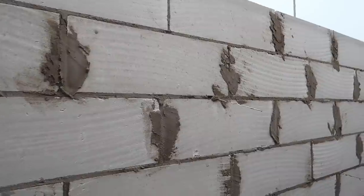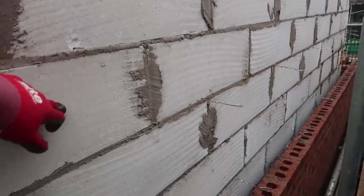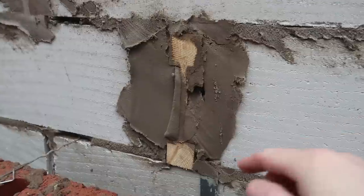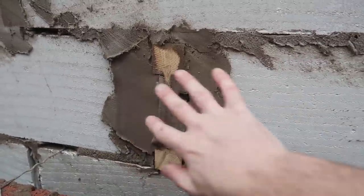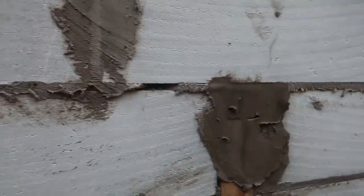That's what we're looking for at the back of the blockwork as well — nice full joints, nice and clean, all scraped off. The insulation is actually being pumped in after the build, but you've still got to keep your cavities clean. That's what the joist sits on top of at that height. The joist goes on there for the floor, and then you just put your blocks in between and then you build over the top — that's how that works.